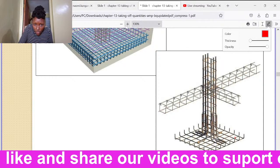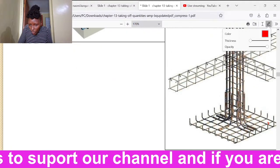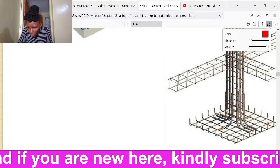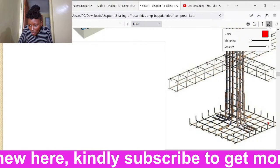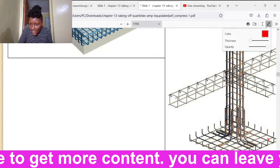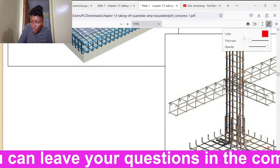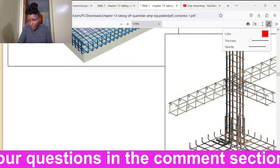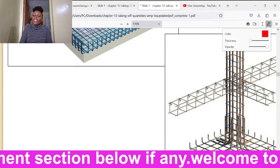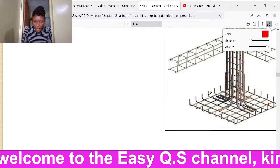This one, there's a point I want you to note. If you look closely on this one, the reinforcement bars that are coming from above here usually lie on the mesh below here. Then once we have these bends, they are tied towards the ones that are straight. So we shall tie them together. All right? Then these ones will go past. Then if we have the ground beam, it will come and pass through the column. All the reinforcement should be tied together because they are the strength determinant in a building.